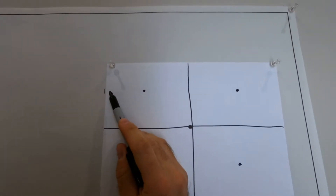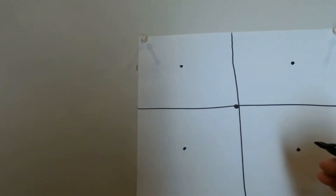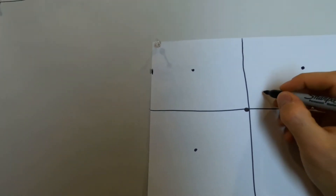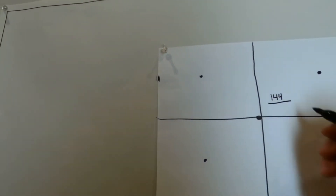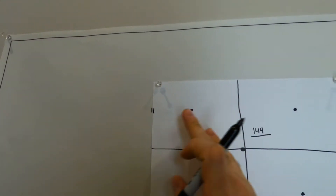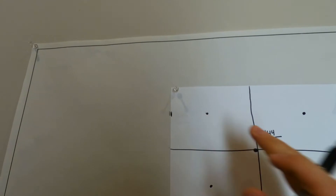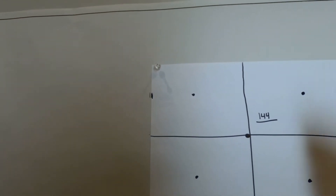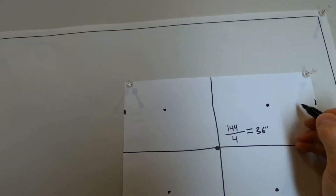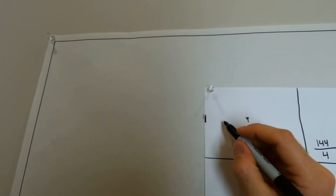The first thing we do is we measure the room from here to here. So let's say the room measures 144 inches across. We're going to divide this room into two and then divide it into two more to get to the middle of each section — basically dividing it by four. 144 divided by four equals 36 inches. So from this wall to here, 36 inches. Same on this side, from here to the light fixture, 36 inches.